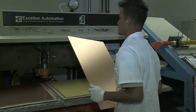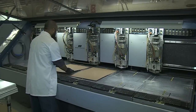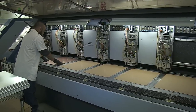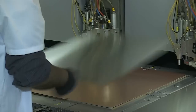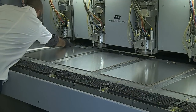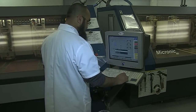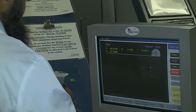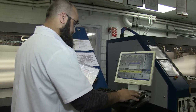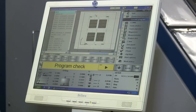The panels are now ready for drilling. We drill the holes for leaded components and the via holes that link the copper layers together. To set up the drill, the operator first puts a panel of exit material on the drill bed — this stops the drill from tearing the copper foil as it comes through the PCB. Then he loads one or more PCB panels and a sheet of aluminum entry foil. The drilling machine is computer-controlled. The operator selects the right drill program, which tells the machine which drill to use and the x-y coordinates of the holes. Our drills use air-driven spindles which can rotate up to 180,000 revolutions per minute. High-speed drilling ensures clean hole walls to provide a secure base and good plating on the hole walls.